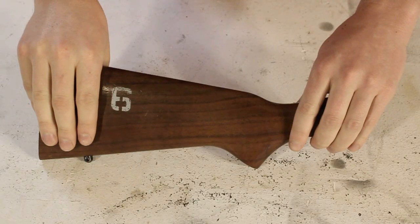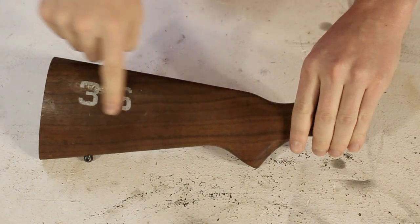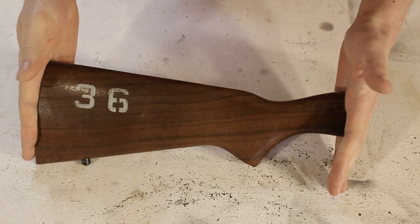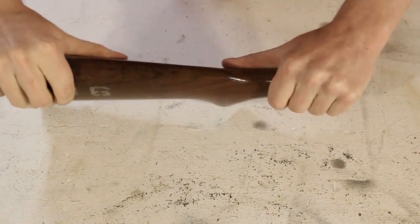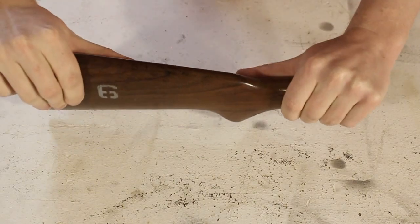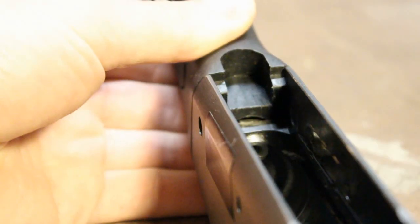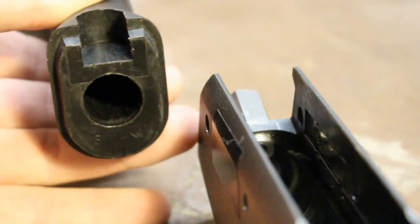This is why any properly made wood gun stock will have the grain running longitudinally. This orients the cellulose fibers to best handle the compressive forces of recoil, as well as shear and bending stresses applied vertically or from the side. Even fancy figured stocks that give up some strength for aesthetics retain the stronger and more predictable straight grain in their narrower grip sections.